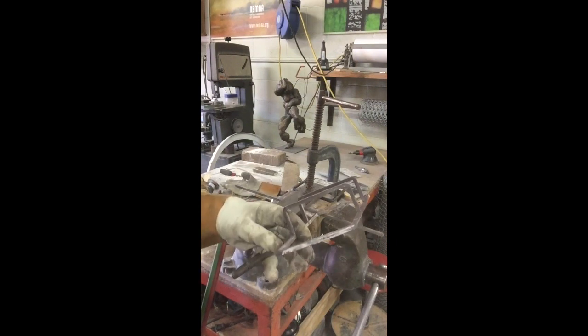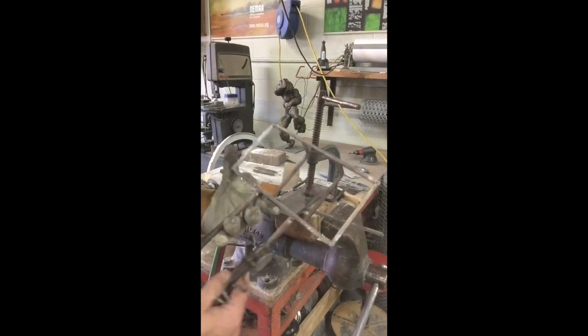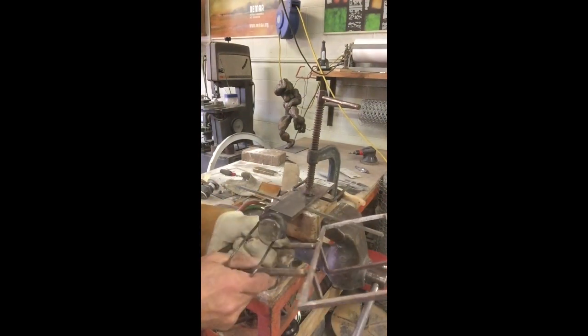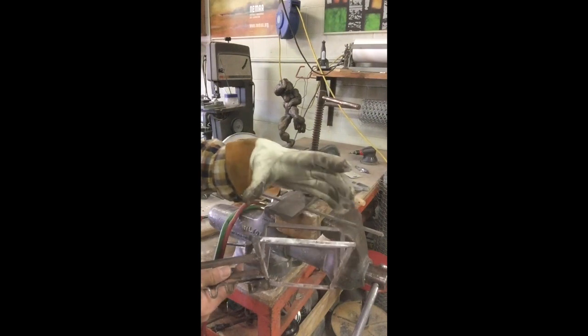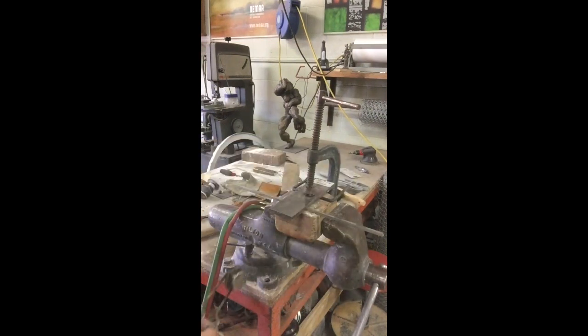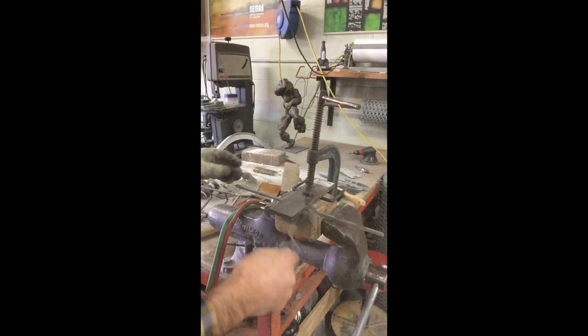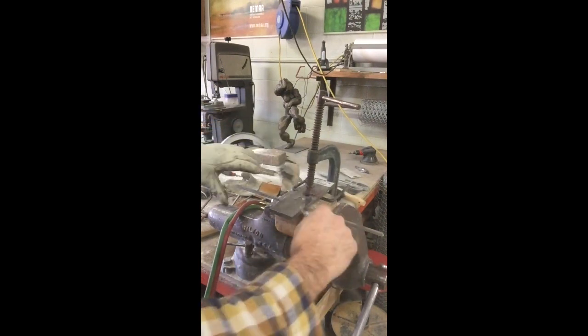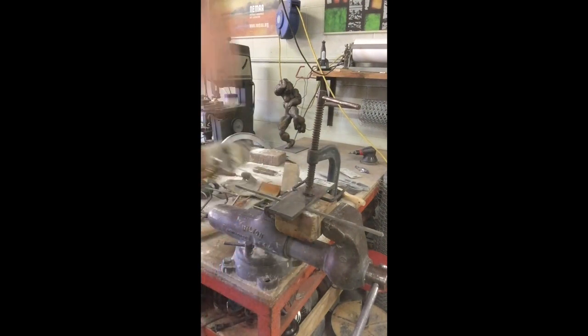Because I'm going to a thicker brick I'll have to remake the U-shapes on my holder. The holder is just made out of steel — a U-bolt and some quarter-inch square steel — so it keeps it light, but the double sides make it easy to tip and pour. I want this to hold the brick a little deeper so that the weight is balanced. I've used a brick in the vise, clamped the top down, and now I'm going to heat both sides and bend them down.